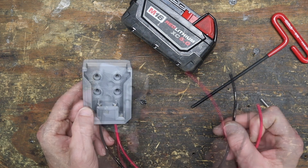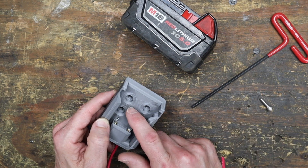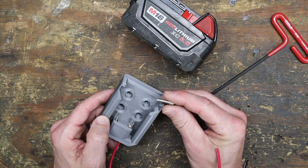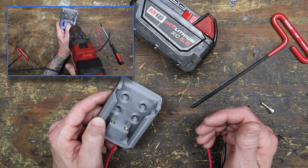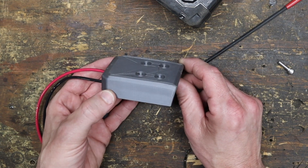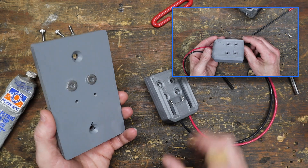There are a few issues worth mentioning. The mounting hole through-hole is a bit odd — it doesn't fit a 10-24 or a 6mm socket head cap screw — but you can drill it out easily since the plastic machines well. Also, the back of the unit has a noticeable curve to it. I could hear the plastic start to stress as I tightened the screws before realizing it wasn't completely flat. I shimmed it up with a couple of washers, and that took care of it. Keep that in mind if you're mounting it to anything flat.